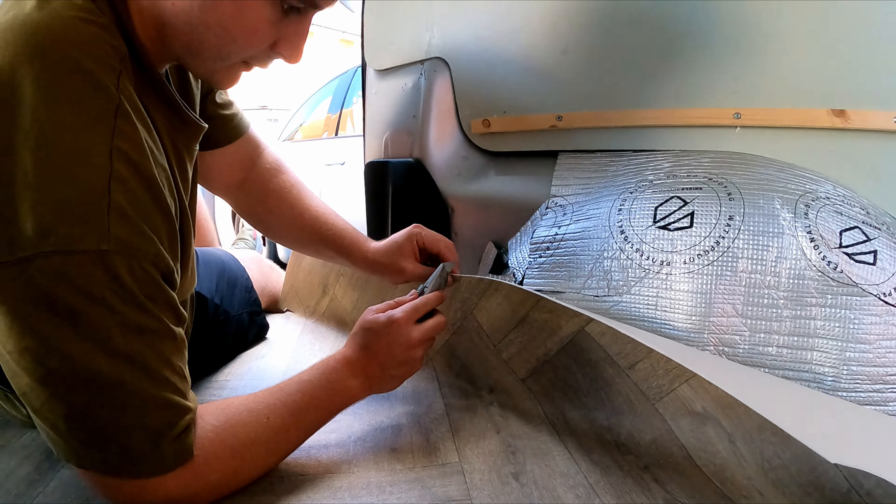So that is all done — I'll show you from the back. Now what we're going to do is stick it down with contact adhesive. You spray it on both sides because it's contact adhesive. You need to spray a good layer, leave it for about three to five minutes, let it fully dry, and then stick it down. You do it a bit at a time — half at a time. Stick down this half, then pick up that half and do the other half.